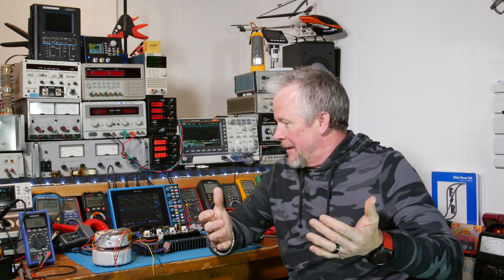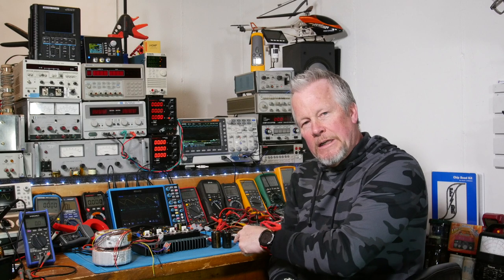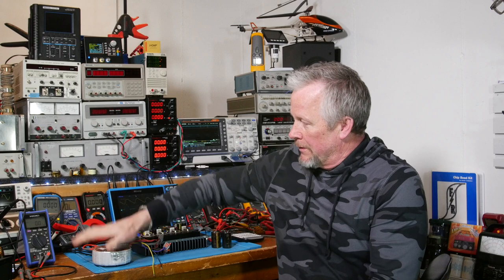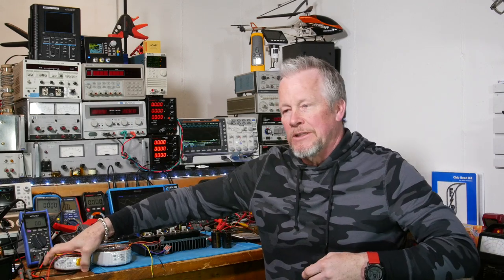All right, we're getting close. I'm going to keep these videos kind of short so we can stay on point. Right now we looked at transformers, we looked at caps last time, and previously we looked at what the worst case was — 20 hertz — and before that we looked at what voltage we actually needed out of this power supply to keep this guy from distorting. Now I'm going to start putting things together and I'll explain why I'm choosing a certain route, but I'm not dead set yet. There was a suggestion to use a bridge rectifier for each amplifier and its own set of capacitors off that bridge, for some separation from the transformer. I like that idea.